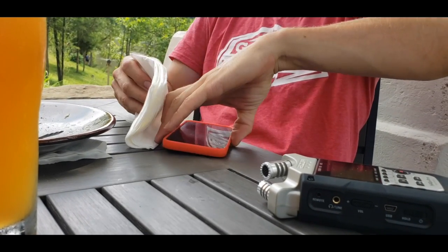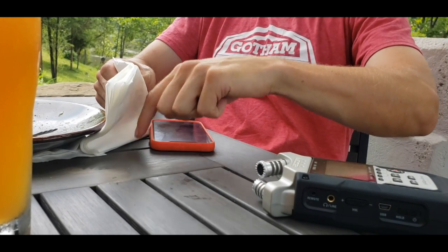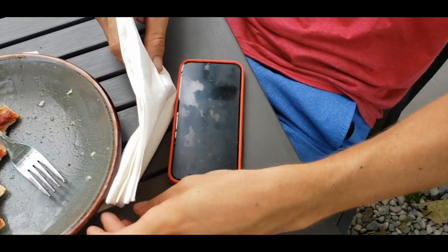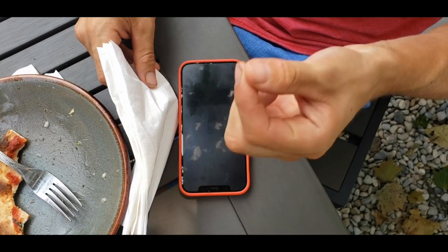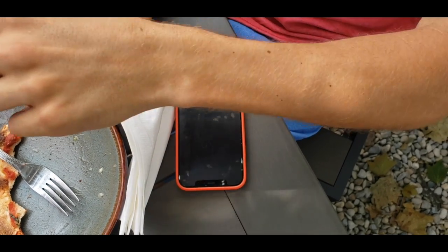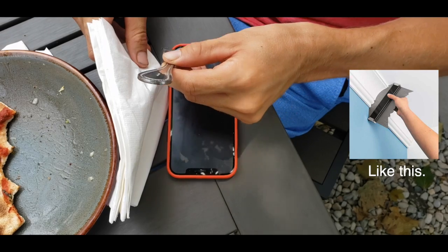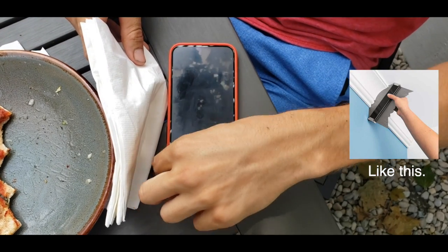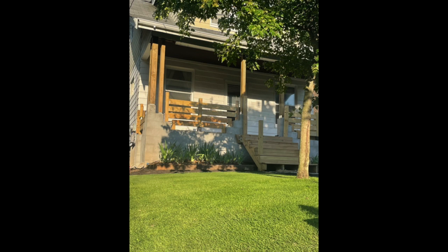So if you put a flat piece of wood there, you're going to have huge gaps — obviously that's exaggerating. You can't just put a tread there, that's the part that you step on. What you have to do is get a pencil with a washer and drag the pencil along, and it'll draw the warpness. Then you cut along that line and it fits in like a puzzle piece. I have to do that like three different times, because it's not just that board — the next one has to do it too, and the verticals also have the same issue. So it's all warpy issues on that last step.